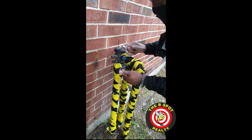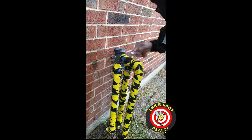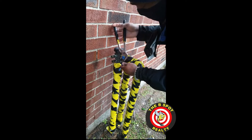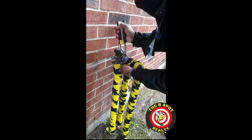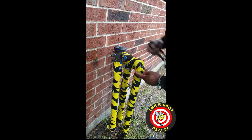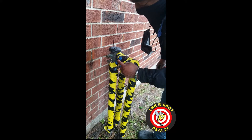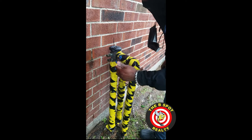Once that finishes draining, all you're going to do is leave those valves open, and then you're going to open it to a 45 degrees, which will let the rest of the pressure from the sprinklers back out. We're going to leave this one shut off, leave this one at 45 degrees, and that drip will stop.